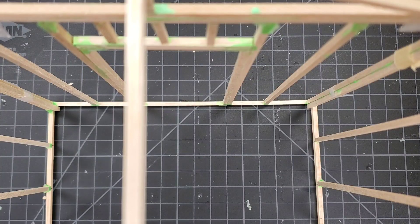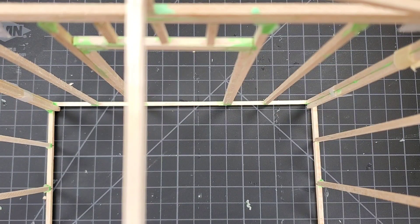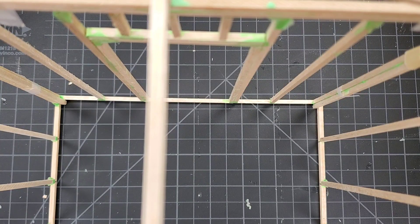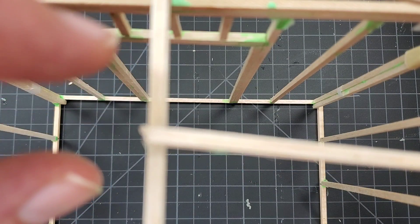Before placing everything up, make sure you have your spacing — you can use a ruler to measure or estimate. Mark where each rafter goes. Take your next rafter, put glue on the end and where it's going to lay on the wall, then place it at the mark. Continue measuring two inches from the last rafter and adding a measurement mark for each subsequent rafter.